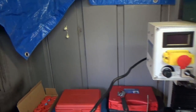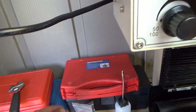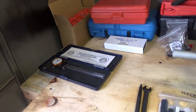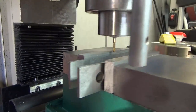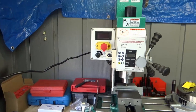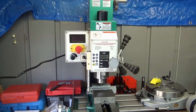By the time you're done with the essentials, you've easily spent more than the machine itself — it's crazy. I also got a collet set, parallels, and an optical center punch — that thing is awesome, I might do a separate video just on that. Calipers are a must, and then the end mills themselves. That little one-eighth end mill just looks like a fancy drill bit — I think it was like 10 to 12 bucks. They snap like twigs when you don't know what you're doing. Trust me, I know.